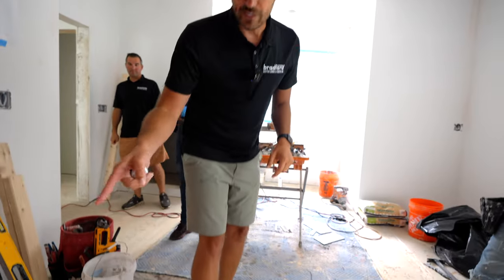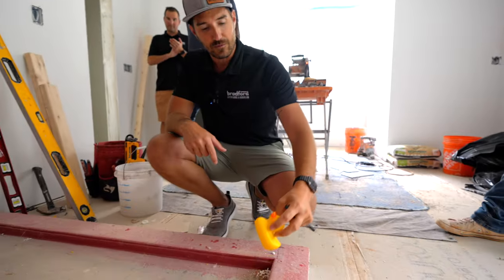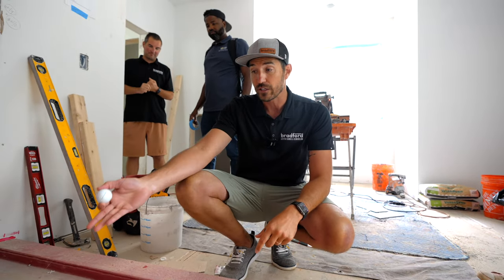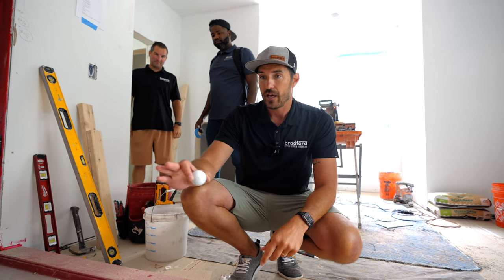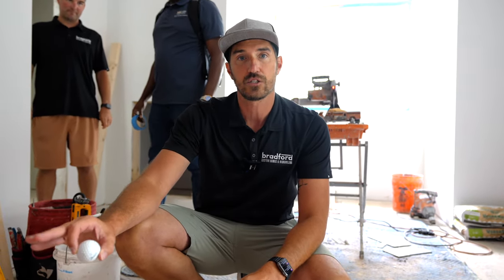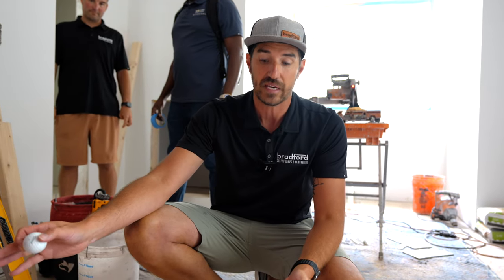While we don't have water in today, we're going to let Rubber Ducky sit aside, but we're just going to test this slope and make sure that we've got good drainage back to the point drain here. And after all the mosaic tile's been installed, we're going to double-check to ensure that we don't have any flat spots, especially in a shower this big.